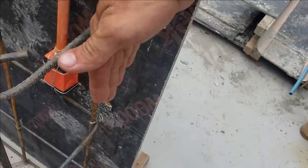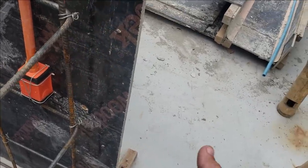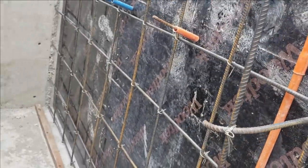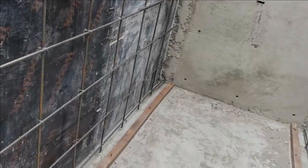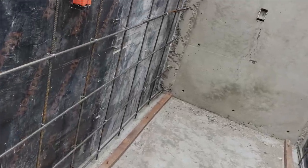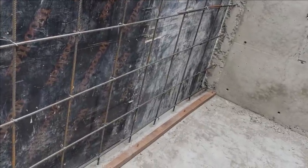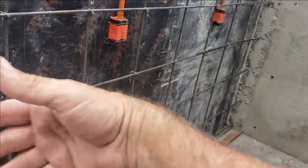You know, just put a dead end, a stop, a block where your wall needs to end, and leave the rest hanging. Don't just chop everything up. That's where you're really going to waste your wood, chopping everything up. Then try to build to where you know that the sheets are going to work. And let me give you an instance of that. This is 8 foot.